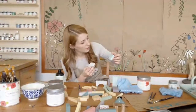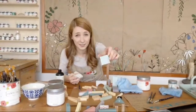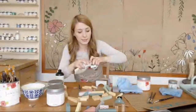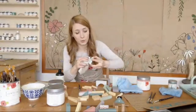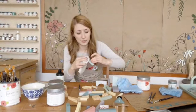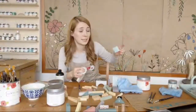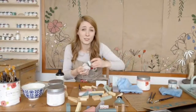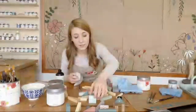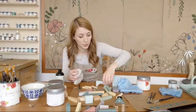So this is hemp oil over fancy frock. It does have a bit of a green tone to it. That's going to go away as it cures. Absolutely fine. What hemp oil does is it's kind of like nature's pledge. You apply it every year or so, depending on how well worn the piece is. You can probably stretch that to 2 years. The dresser I did last year, I definitely don't need to do it still, and that's something I use every day. It looks great still. Has a bit of a nice low sheen and very soft to the touch. That's what I love so much about the natural finishes.